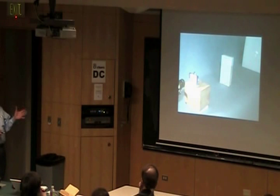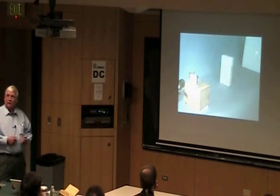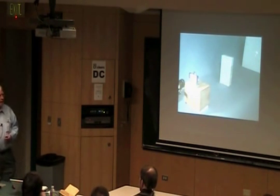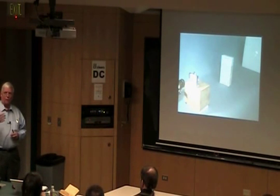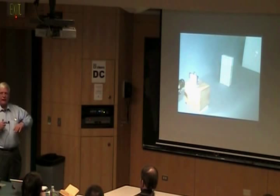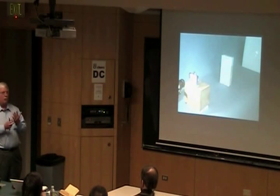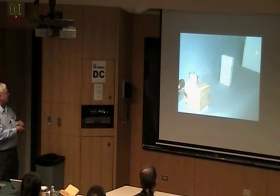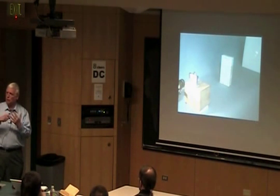Now this is the mechanism that lets that camera focus from infinity down to 26 inches with just a lateral motion of that piece. Mechanically it's very clever because when you take the picture, you have a sonar ranging that tells you how far away the object is. And then there's a little kicker, the solenoid, that just makes that thing jump. And as it jumps and moves, a little sensor counts holes going by, little holes in its frame, and it knows when it's reached the right place, and a little latch comes in and stops.